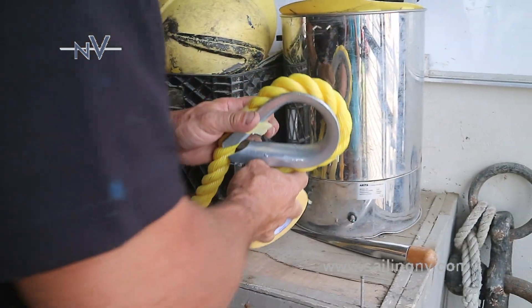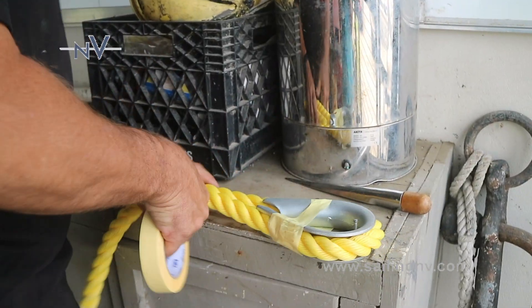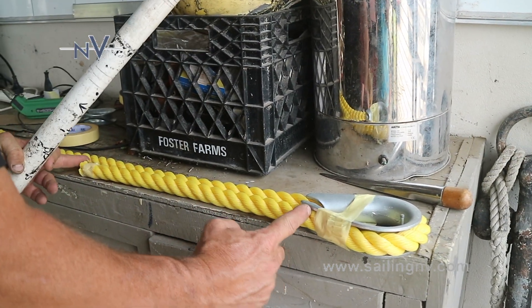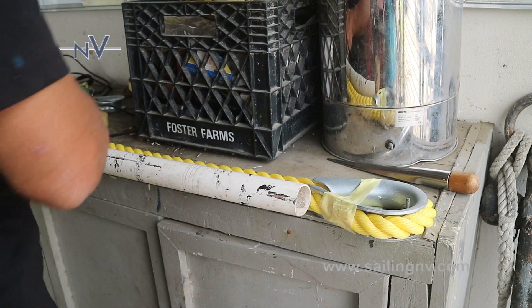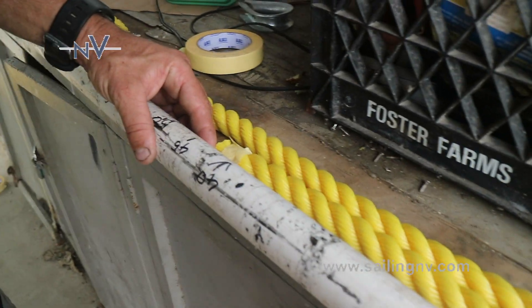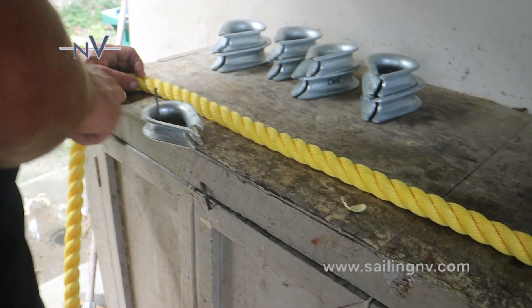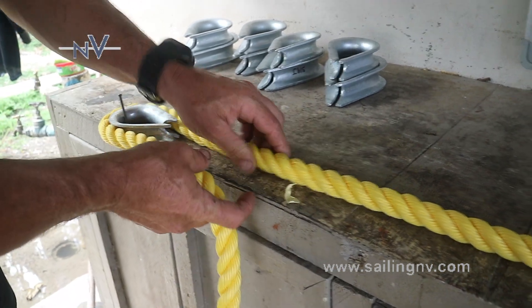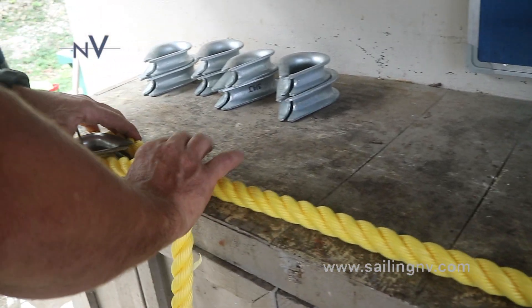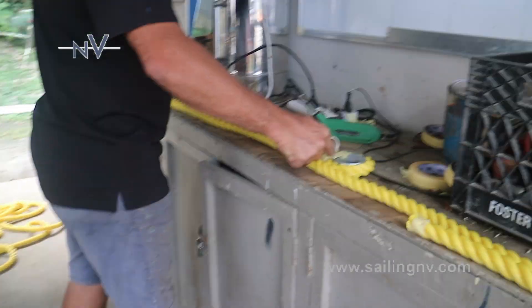Because I work solo, I'm going to use a little bit of tape just for holding the rope in position during this measurement. This is the part of the rope I'm going to open for the splice, and use one portion of rope from here to here — 45 centimeters. We go to the opposite side. The opposite side is not important; we use a thimble of a different size because the three meters of rope is where the thimble will hold the next connection by a shackle or other rope. Now I keep a little tension, and I can cut the 45 centimeters of rope I'm going to use to do the splices.